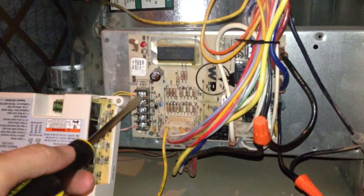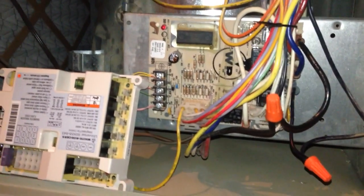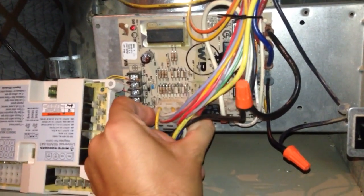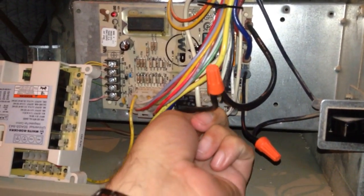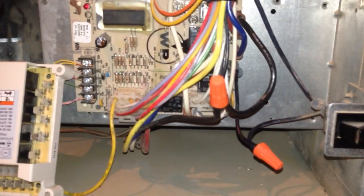So these wires here, you just unscrew those. Each one, slide them out, keep track of where they go. This is called a Molex plastic plug. I'm just going to squeeze the tabs on the side of this and unplug that. Same thing goes for this one, and the rest of these little tabs, you just wiggle them, not by the wire, but pulling by the plastic base, just like your mom told you to when you unplug a vacuum from the wall. Grab the plug, not the wire.